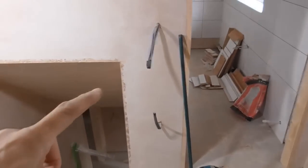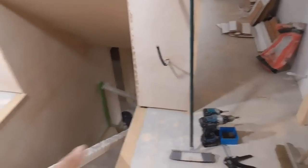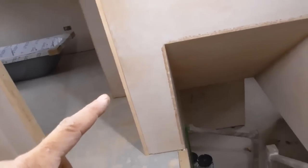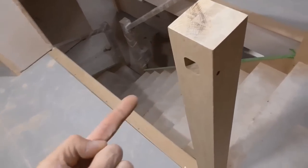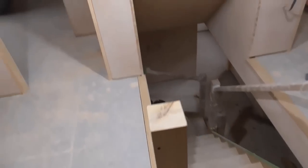Fitting nicely down over this string here, nice into this corner. Next job is I've got my half newels here, so what we need to do now is get those half newels fitted. I won't fix them because I've got to get the handrails in - once that half newel is up against that wall I can get a measurement and cut my tenon on the end of it. We've got a length of handrail coming through here, mitred at 45 degrees and then goes into a tenon that goes into that newel post, so let's get on with those.